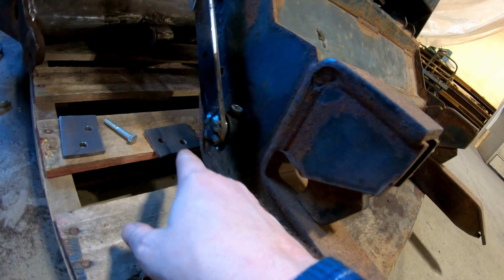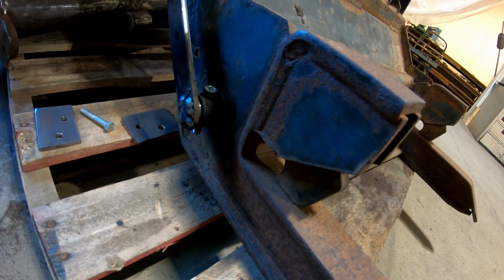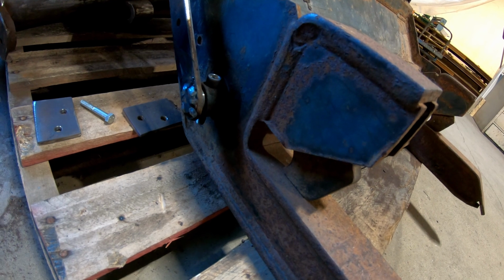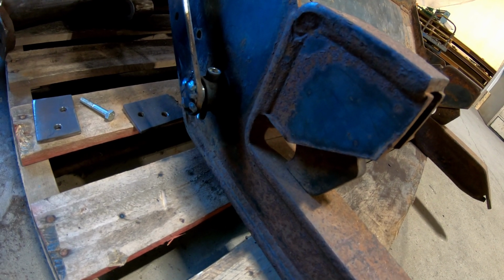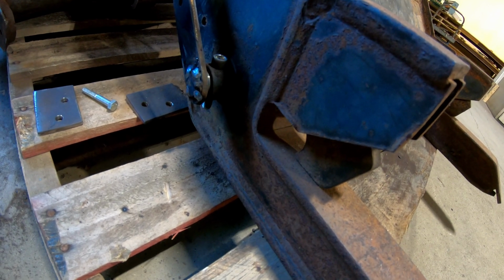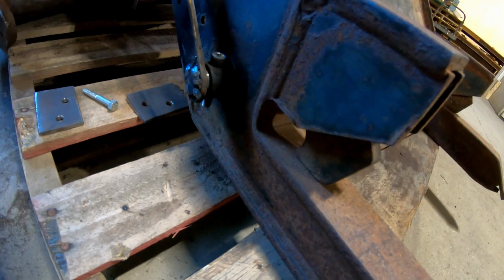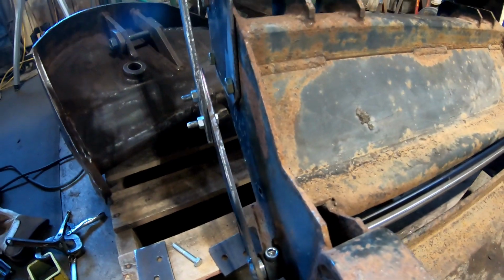And the first thing I did was I heated this with the torch. Did the shaft itself, got it warmed up a little bit before I started welding on it. Then I welded it without gas. Then I ended up grinding off the welds I put on without gas, and turned the gas on. So, all right. Okay, so I took everything out.